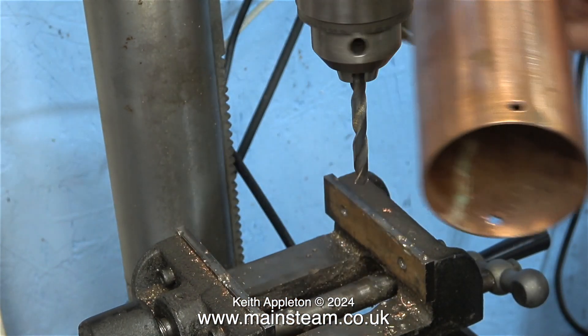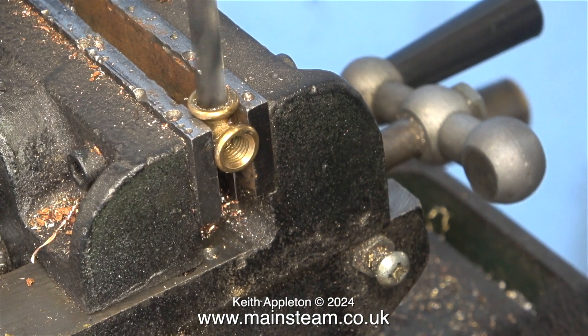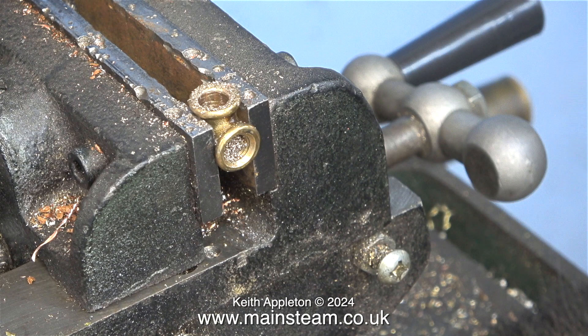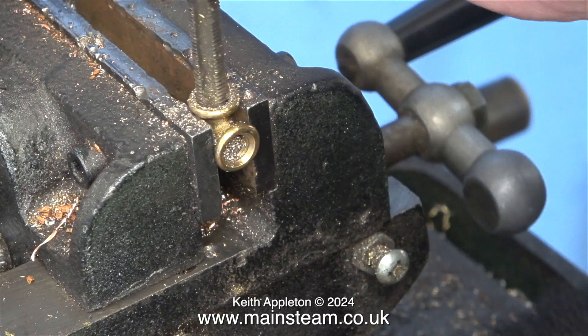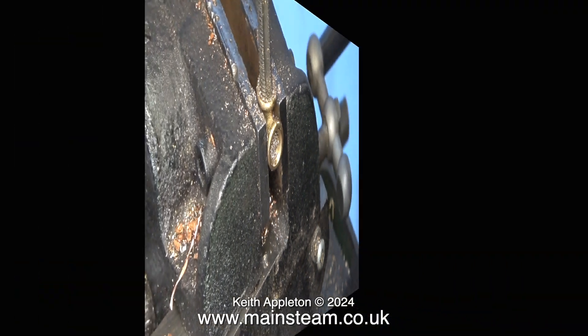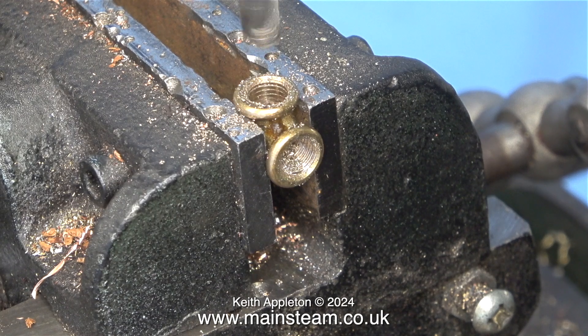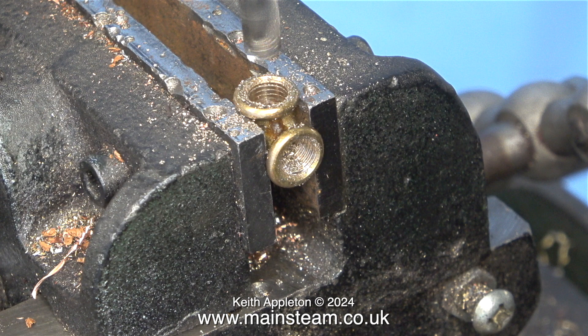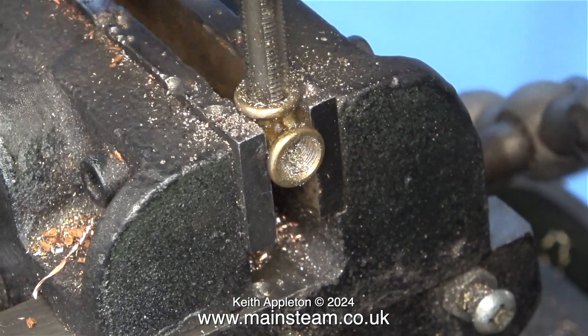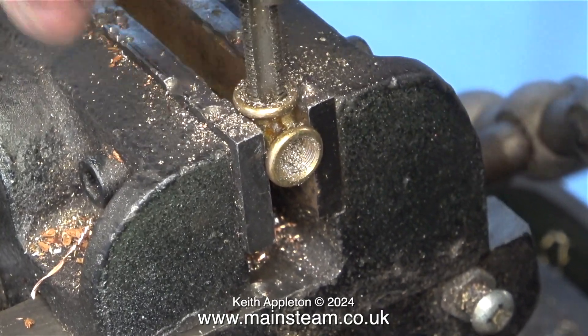The holes are both drilled. Now I'm going to turn my attention to re-threading the PM Research elbows. I've never used a 27 threads per inch tap — I've used plenty of 26 threads and plenty of 28 threads per inch. So I'm modifying the PM Research elbows as usual, using a tapping size drill for 5/16 by 26 threads per inch. Here, with the part still in the drilling machine, I'm threading it. This is a bit repetitive because I had to do both sides. Here I've turned the part around in the machine vise. The tapping size drill for 5/16 by 26 is 9/32 of an inch. I'm threading this side of the elbow 5/16 by 26 threads per inch.